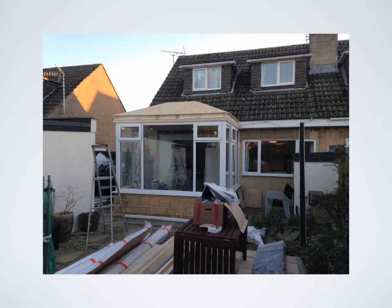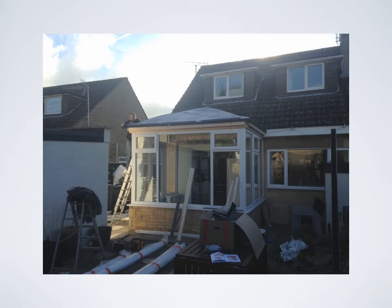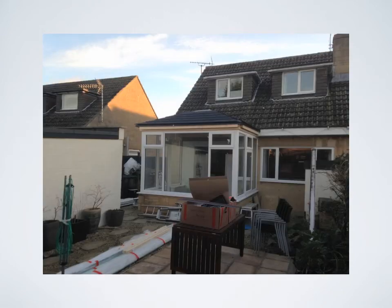This photo shows all the roof panels installed. We can now see the elegant new roof design taking shape. The roof is now strong enough to walk on. The next stage is to fit a breathable waterproof membrane, as well as support trims to make sure the rainwater flows directly into the guttering. The roof is now ready for tiling. Each tile is fixed individually with screws. On this particular roof design we had a lot of tiles to cut to shape, completed by hand on site. The photo shows the roof isn't quite complete as we still need to install the ridge cappings and guttering.